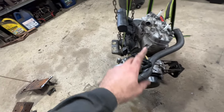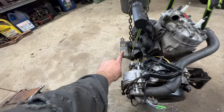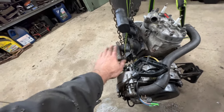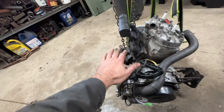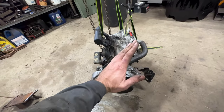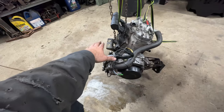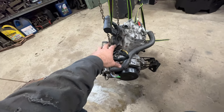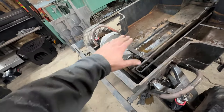The one thing I'm going to go off of is the back motor mount. When this was in the machine, it was actually level — the engine ran parallel to the chassis. Snowmobile engines are usually clocked a certain way and I'm going to try to leave it at that angle. So we're going to put this in at that orientation, pick it up, move the tub back, and see where we can get a position.